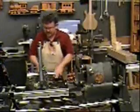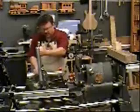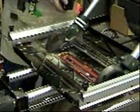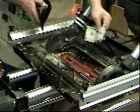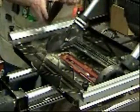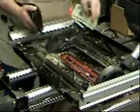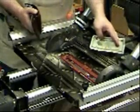To prevent this, get it nice and loose, loosen the table tilt lock, and get yourself a 5/1000ths gauge, like a dollar bill. A dollar bill, if the paper is about 5/1000ths of an inch thick. Jim McCann, a good friend and a good craftsman who works here, he uses a $20 bill because he says it makes him pay closer attention.